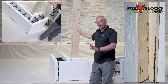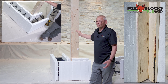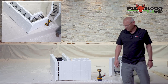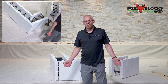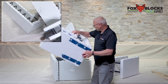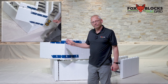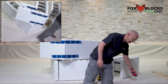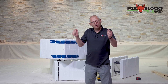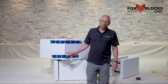In most cases you're only doing one or two block at the top of the wall, so it's really not that big a deal. This is going to take longer and be kind of a pain to do, and a lot of guys will argue they'll never do it. But the way I look at it: get the job done, get to your next job, get your check, put it in the bank, and start becoming a profitable company. This was the 90 I used in our training course — the six-inch one on top, the eight-inch on the bottom. I use some tape temporarily to hold it in place as I build.